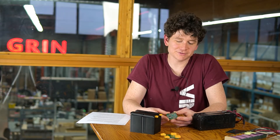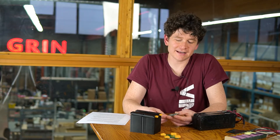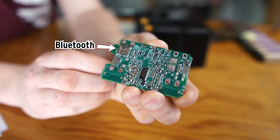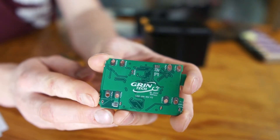With the updated cell layout, we also fully redesigned our battery management circuit board that monitors the cells. We used this opportunity to redesign it around a Bluetooth module, which ensures wireless connectivity so that people can do diagnostics and troubleshooting on their battery without having to open and probe into the casing.